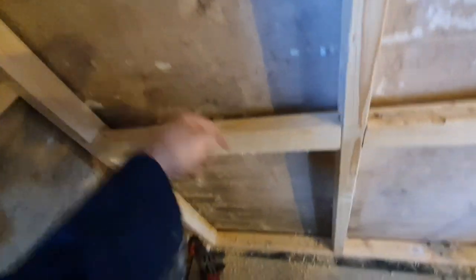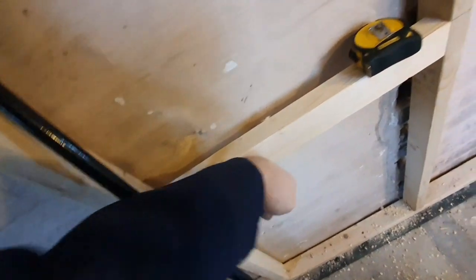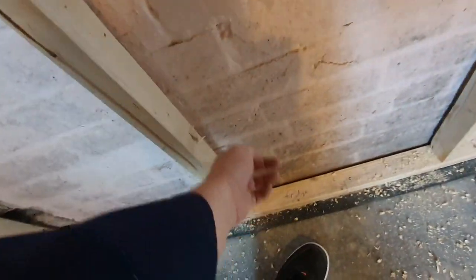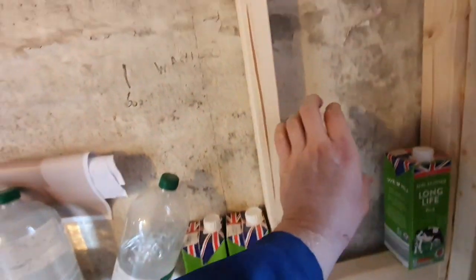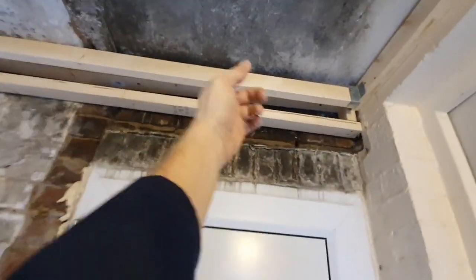Plasterboard box, straight back down, in through here, and then into another plasterboard box which will go in there. Send the cable back down and across into this middle fridge-freezer socket. Straight out the side of that one, across all the way, and then from this section I'll run up behind this so I don't have to drill it — plasterboard box, back down, across, back up, plasterboard back box — and there'll be a socket in there for the washing machine. It'll go straight into that socket, up into the next socket, and then straight up across the ceiling. I'm just going to run this cable across the top of these, back in through there, and that makes the loop — that's the return.